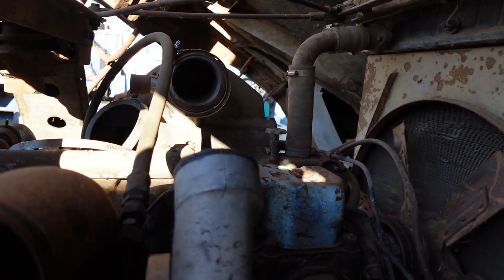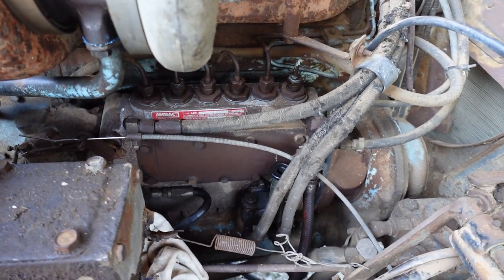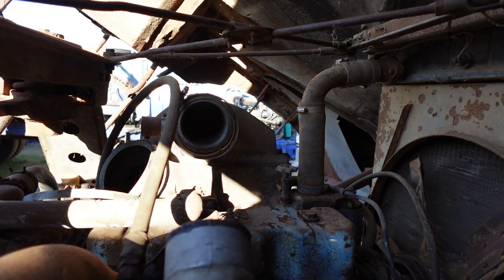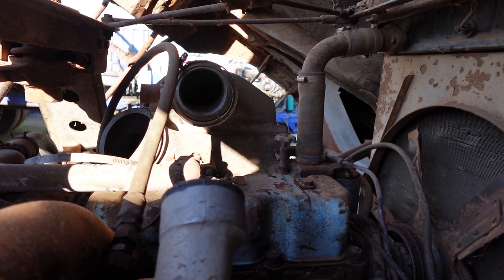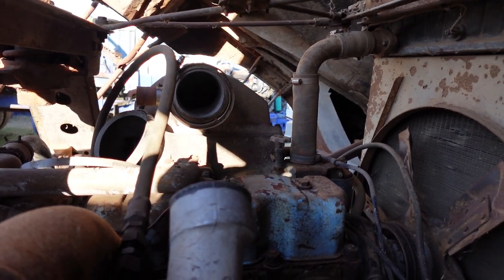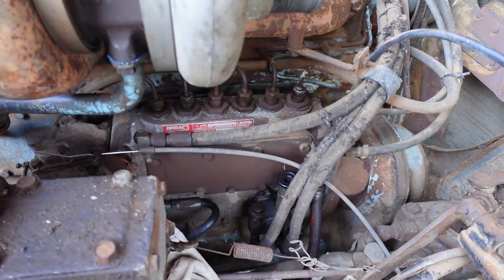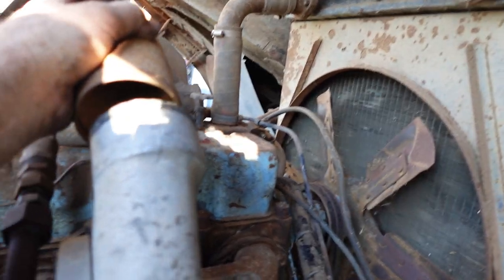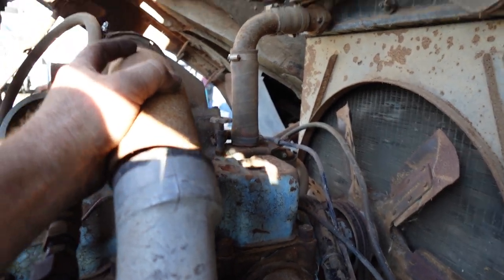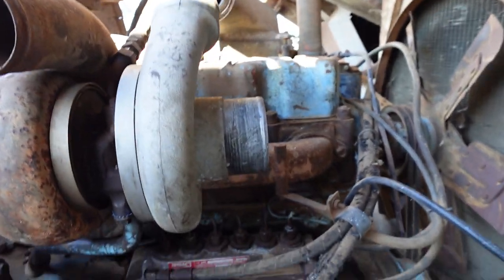But also, just in case, for whatever reason, if that pump wants to run away like the old Cummins did, we've got a way of stopping it. So let the turbo just spin and put the pressure side out to atmosphere for a little while. We'll get it running, make sure the pump's going to do the right thing and behave itself, and then we'll hook up this hose, find a piece of boost hose for this bottom side of it, and put that V-clamp on back up there. Anyway, just for the time being, it'll be right.